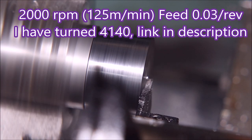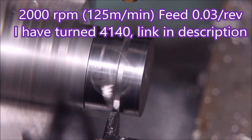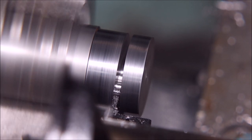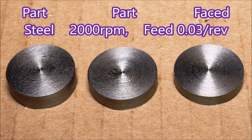It is starting to run a little dry. I'm using spray mist coolant and it's not putting out as much coolant as I'd like. I find it really difficult to get a spray mister to run with any sort of consistency. Here are the results — the one on the right was faced off, and the other two are the result of parting that piece off.